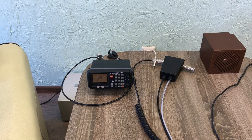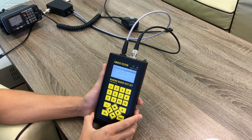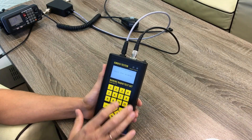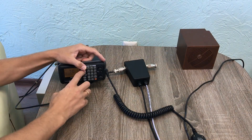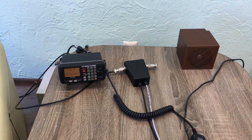We have two options: we can send a distress call to all ships, or an individual test call to our station using its MMSI code. Let's check that the station is capable of sending the distress signal and measure the frequency and power level on channel 70. We go to the receive DSC menu and go to waiting mode, then we send the emergency signal from the station using the red button to initiate an immediate distress signal.